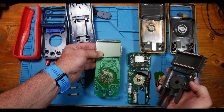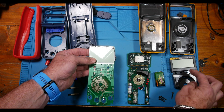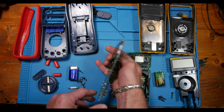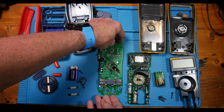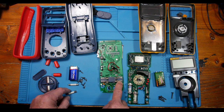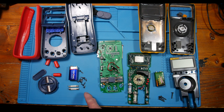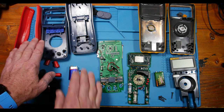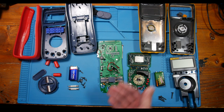The display sits here and makes contact like that. On the Astro side, you can see the board is very clean — just switch contacts, no other circuitry on this face. The fuses — the 10-amp fuse goes here, the half-amp fuse goes up here — they're 600-volt rated. There are screws that hold the board into the front panel to keep the display secure. Yet the board is fairly simple: we've got MELF-type resistors, power resistors up here, surface-mount components, electrolytic capacitors, some diodes, and a bridge rectifier.